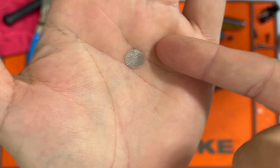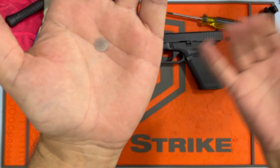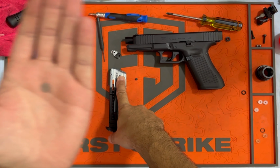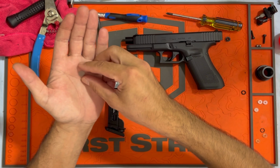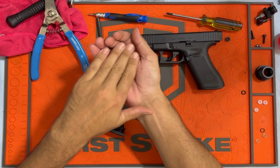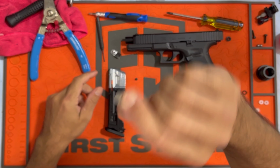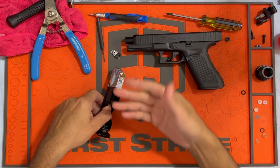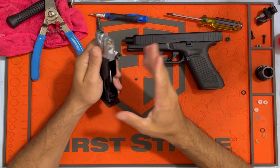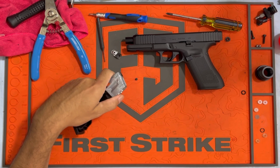Now this would be a CO2 diffuser. The object of this is that it keeps grit out of your valve area here if you got dirty CO2. Oops, hands in the way. But it also mitigates liquid ingestion. So liquid CO2 hits this and disperses, it breaks up, and then has an easier time turning into gas. So I've removed that. And the pin just literally dropped back in, and away you go. And that is all that you saw. That's what got me to 11 joules.